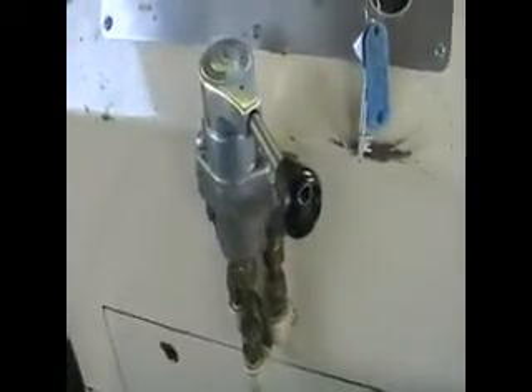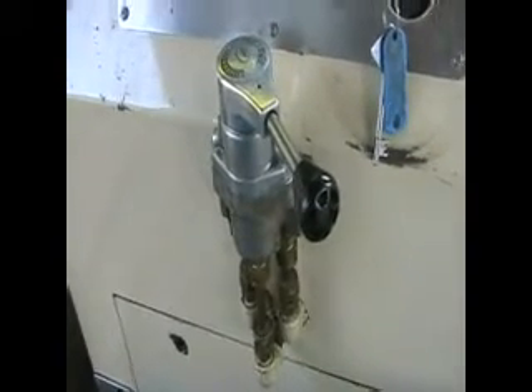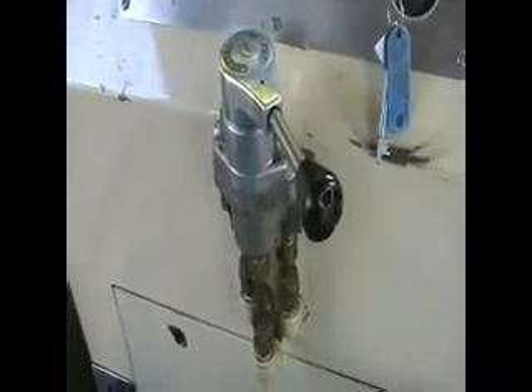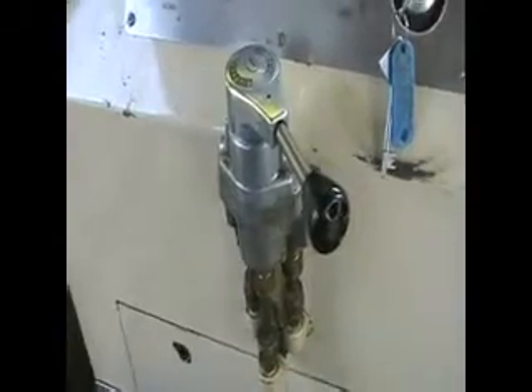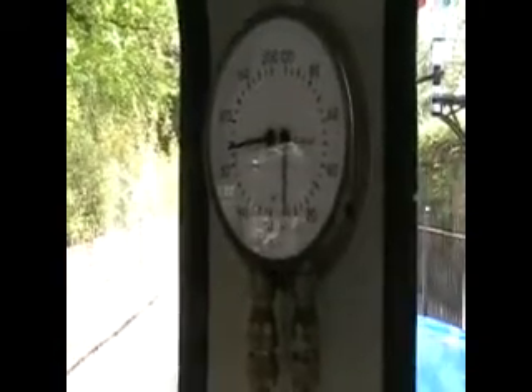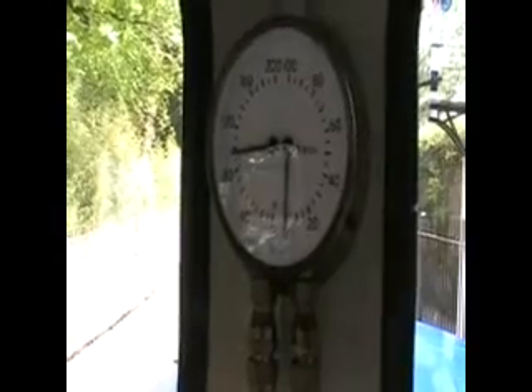Right in front, straight air brake — just like we have on ours, works exactly the same. It works actually as a caliper brake on this engine as the braking of the engine, and tread brakes on the coaches. It's obviously all set up to run with the coaches. Down the side there, there's a fire extinguisher, and at the top is your main res and train brake. The difference on here is it's been held on the handbrake — zero is actually off, and the brakes on the train are all released. But as soon as you put air pressure in, like we're doing now, that brake's coming on.